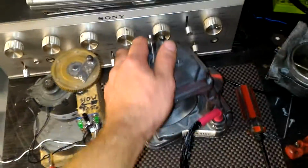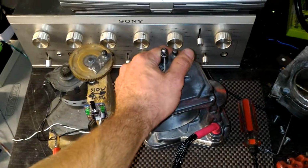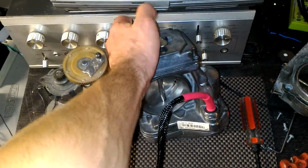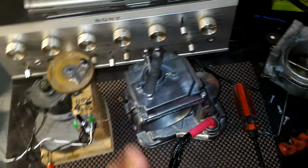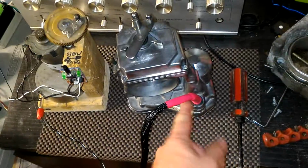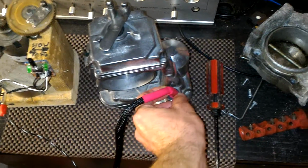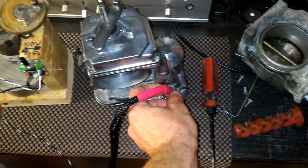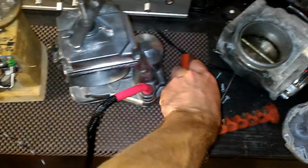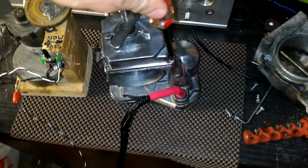So when I had it on the bench for about 16 hours, it became very hot and water started to evaporate, and most water was actually sitting in this area here and on the circuit board. So it started to vaporize and start to drip, and it accumulated on the board, and it actually started to short out terminals, which is bad.